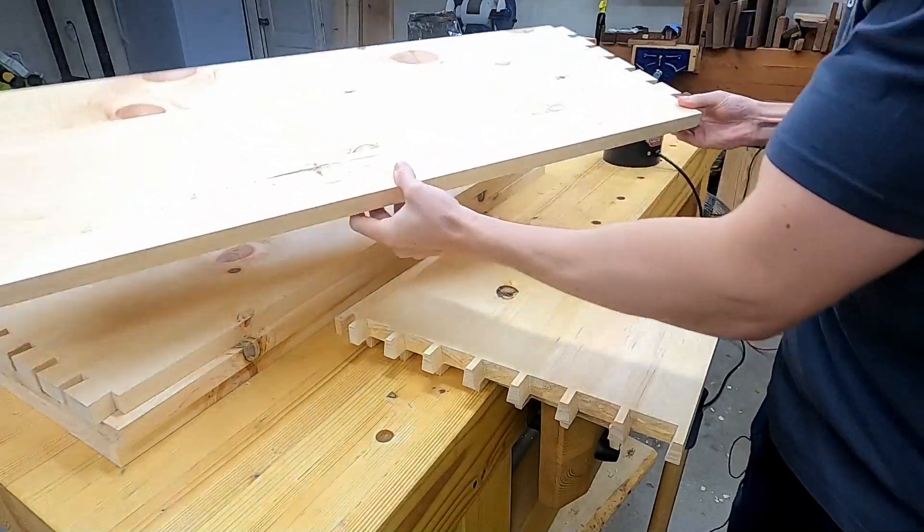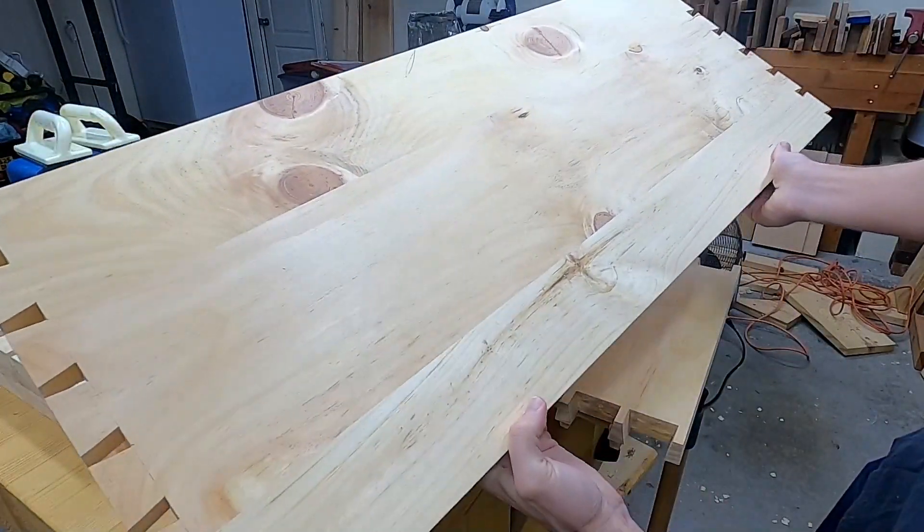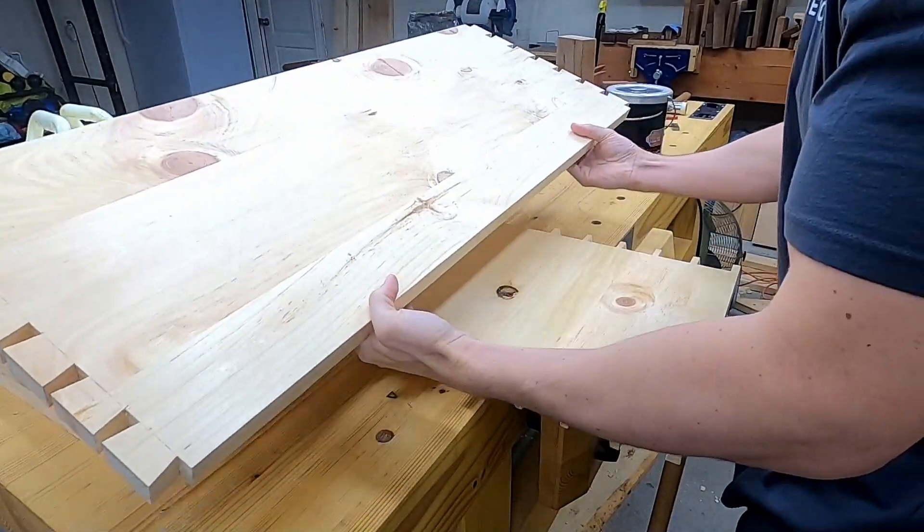Big corners have a lot of surface area, a lot of friction, and I don't necessarily want these dovetails to be super tight, but I want them to look tight. The size and weight here adds some risk to over-tight dovetails. This is over 40 inches long — quite a bit of weight and also leverage — and some of the sensitivity just gets lost if I'm malleting this thing together because it's cumbersome.